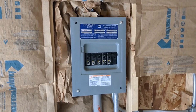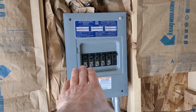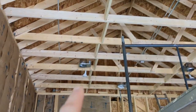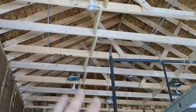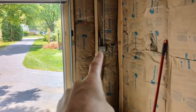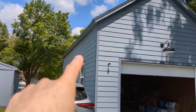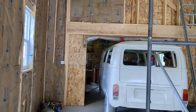Hey everyone, thanks for rejoining me on this Garage Rebuild series. In this part, I'll show you how I connected all of my electrical system here. This will include the can lighting and lighting outlets in the ceiling, and all of the framing that had to go into the ceiling to make that ready for drywall. The two-way switches to turn on or off the main lighting on either side of the garage, the outdoor lighting, the garage door opener circuit, the 220 circuit to the compressor, and the shop lighting and wiring.